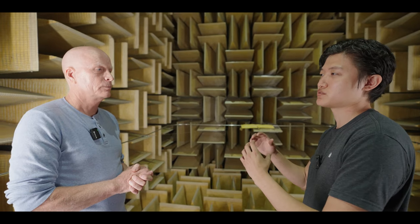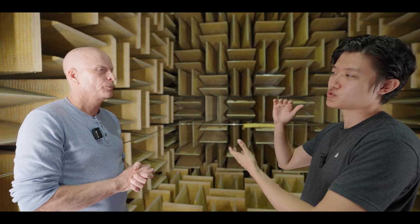When you are measuring speakers, what are you exactly looking for — transparent as possible, most neutral, or the Samsung sound? The most important thing is the amplitude response. It needs to be flat — you can't accentuate some tones and push back others. You want it to be neutral. That applies to the direct sound going to the microphone or to your ears, but also for the off-axis sounds bouncing off side walls, floor, and ceiling — they have to be nicely balanced as well.